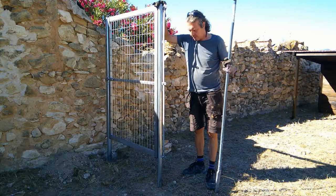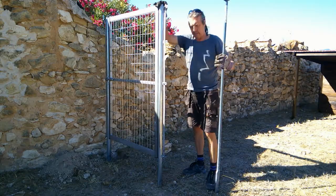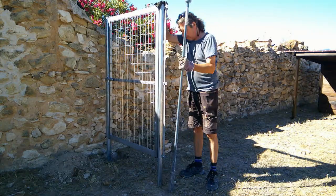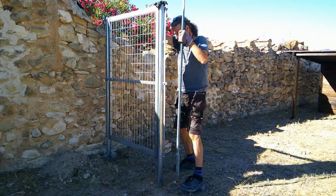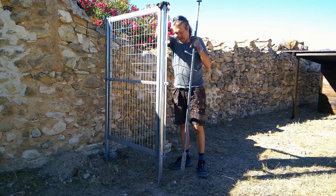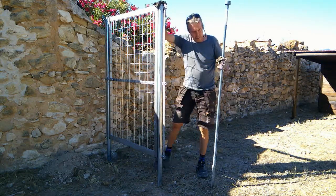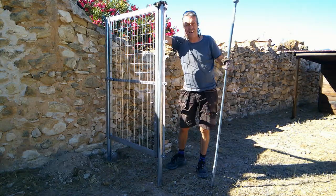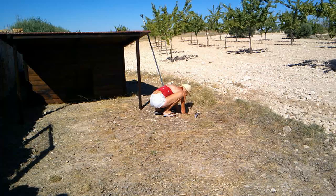The gate is going at the end here against the wall. We did our first hole yesterday, so we need to do another one here. I'm just going to loosely mark it like that, then put a piece of string across the two to make sure they're in a straight line. This is the last hole.